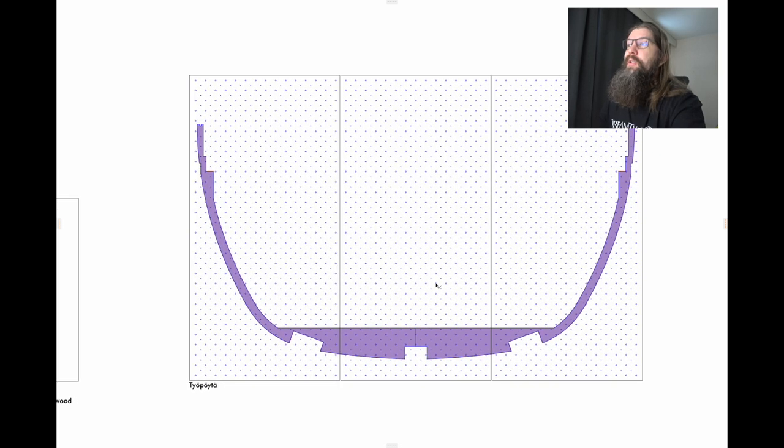What I'm going to do next is figure out what the actual laminated section is here. I think it's probably going to be a half frame or something like that, then the floor piece as a separate lamination, and then the other side, of course. So there will be 3 parts that are then glued together afterwards. That's the plan. That way I can reduce the lamination time for one frame. I can probably do one half of these frames in approximately 4 hours.